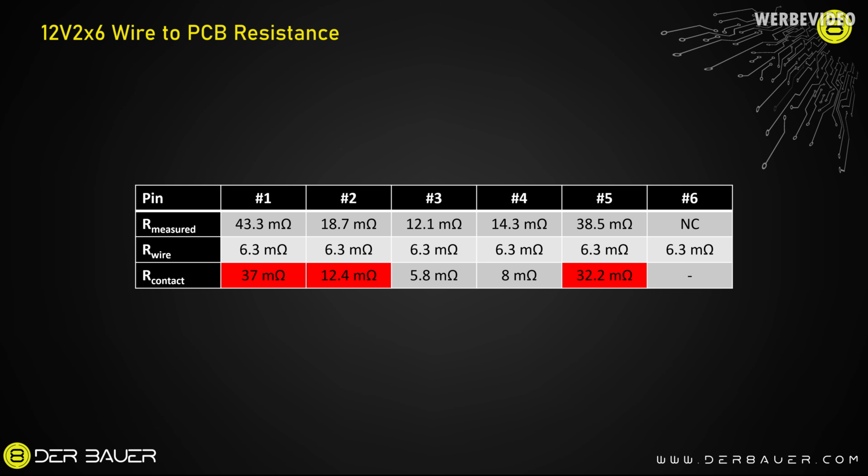And we know with the formula that P equals I squared times R, that the current itself is squared in the equation, which causes much more of a power draw or more of the heat that is being generated. So it's not simply contact resistance or current, it's probably a combination of both, that you have high contact resistance on a couple of pins, which is causing high currents on some other pins, but that is just pure speculation. To be honest, I don't really know what caused the pin to burn.